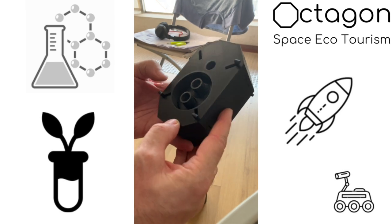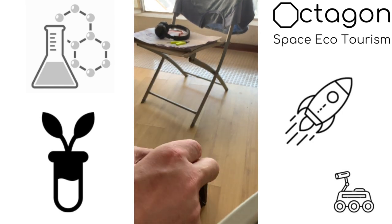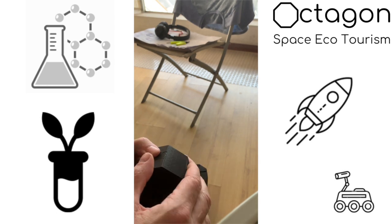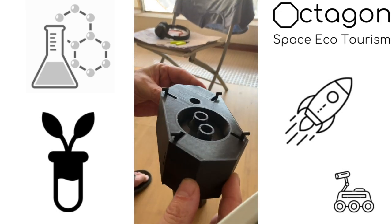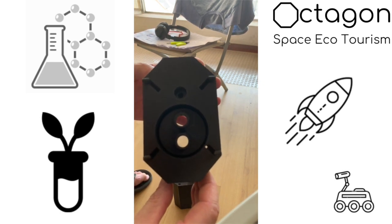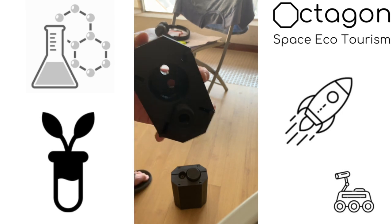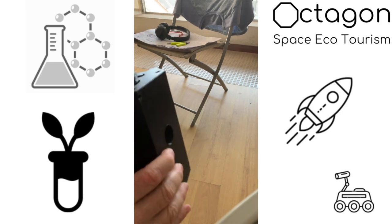It's not absolutely required, but I'm forecasting, after having looked online at all of the other failed attempts, I'm going to call it. If you can create 3D pumps, there's lots of videos on YouTube that show you how to do that. The issue is that all the pumps fail because they can't take pressure. And once you get the pumps working at a very high rate, the plastic actually starts to melt. So if we take the intake fluid, which I'm hoping is going to be cold, we'll be able to actively cool the piston cylinder so that it doesn't melt and we get a longer life, or we can basically operate at a higher revolution. So we'll put that aside and we'll get into the actual internal mechanism.